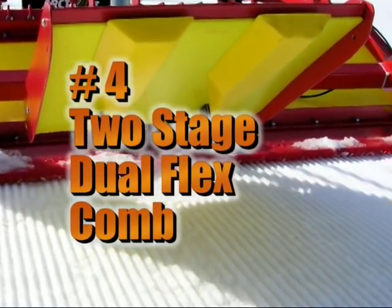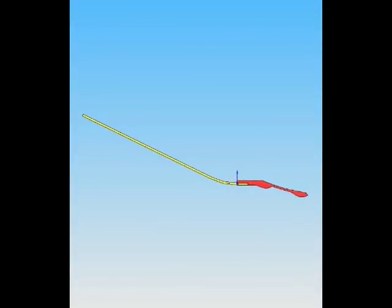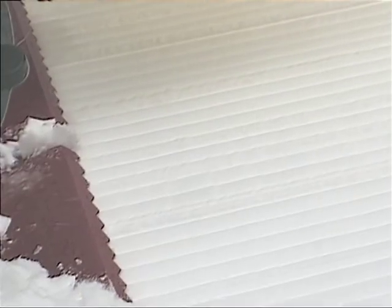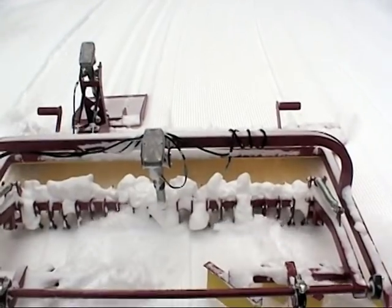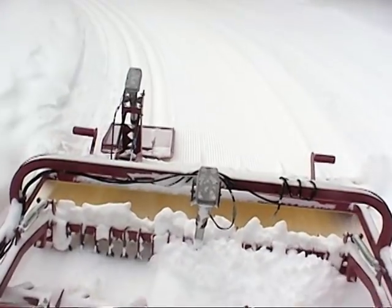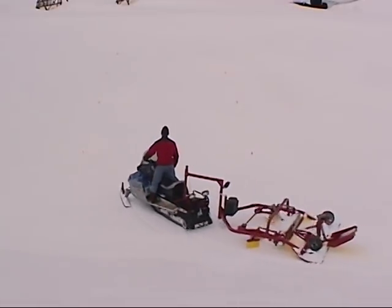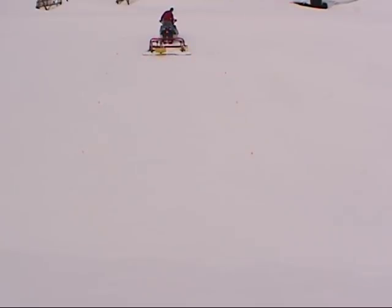The fourth component in the G2 system is the two-stage dual-flex comb. After snow is compacted under the bed, our proprietary comb exerts pressure to form the snow into the optimum comb surface with ridge tops on three-quarter inch centers. The combing performance of the G2 is outstanding even in hard pack conditions. Because the four snow working components work so well together, snow is compacted into the trail and not plowed off onto the trail edges. This produces the perfect comb overlaps and keeps your valuable snow where you need it the most. The unique dual-flex comb design also allows the G2 to back up without plowing snow on a packed trail, which could be a real back-saver when you consider the alternative of unhitching and repositioning a grooming implement by hand.